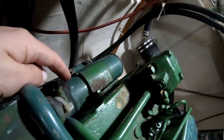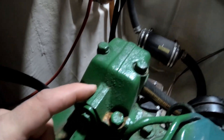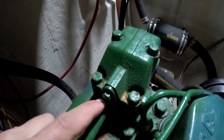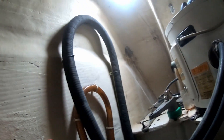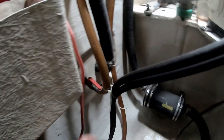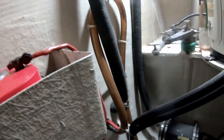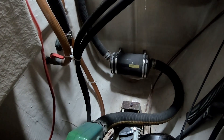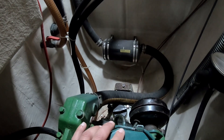From the raw water pump the pipe goes through to the heat exchanger. It comes out of the heat exchanger nice and hot from the engine, then into the exhaust mixer, which sprays the salt water that's just cooled the engine into the exhaust to cool the exhaust gases so it doesn't melt the hoses. Then it goes through the water lock and up in a big loop before exiting out the side of the boat. That big loop prevents water from coming back in and drowning the engine — it's a safety feature that also keeps a constant water level in the water lock to create a muffler effect.